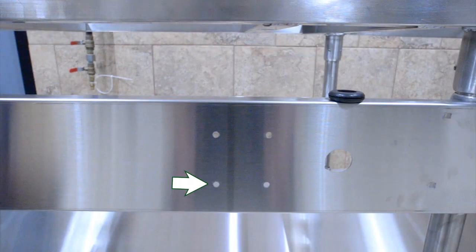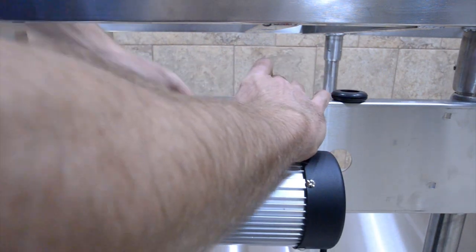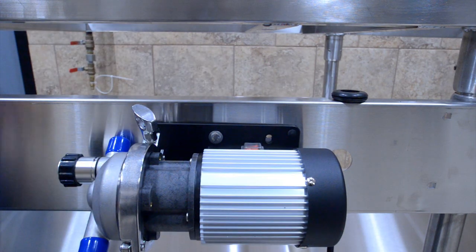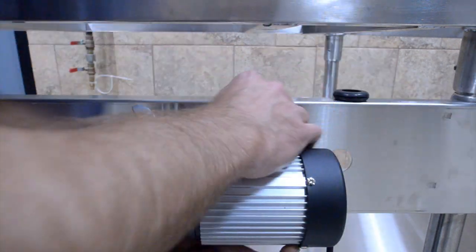On the left riptide, leave the bottom left bolt empty for this installation. Install the left riptide with a 1/2-inch hex bolt, 1/4-inch washer on the outside, and close with a nut on the inside. Mount the 3 bolts and fasteners, then run the riptide power cord through the grommet on the apron.